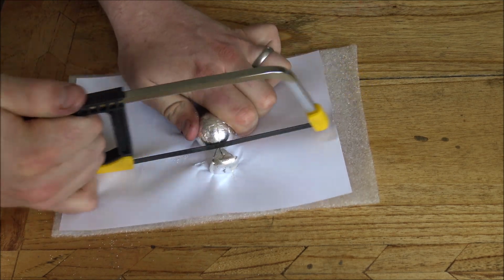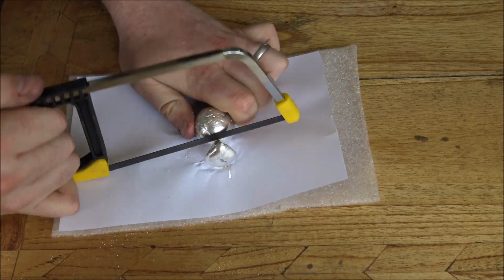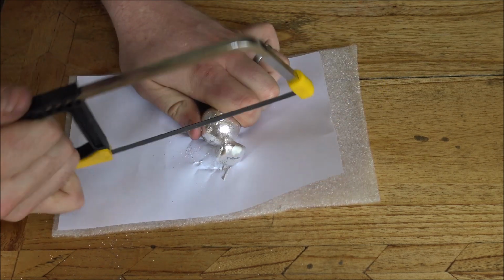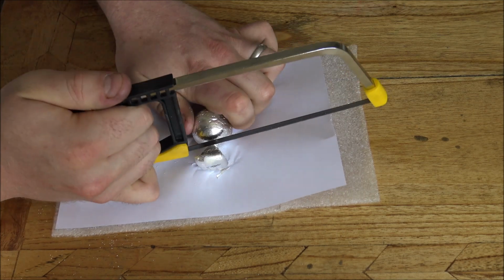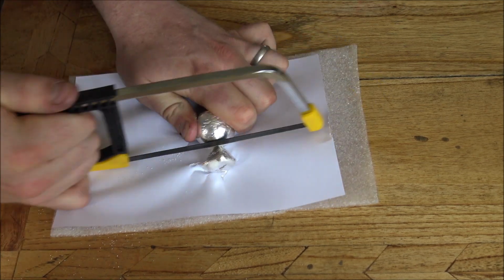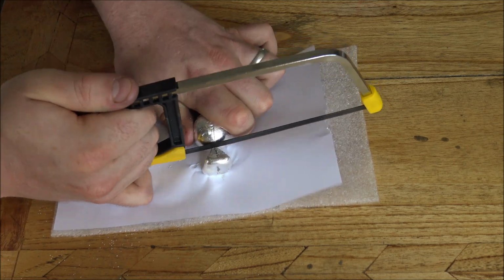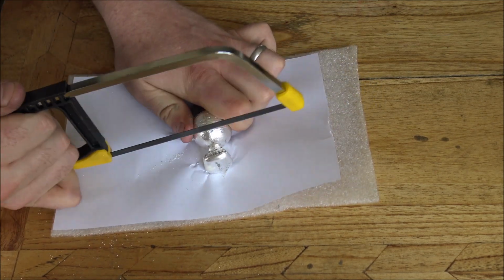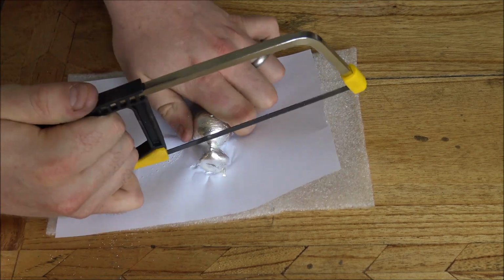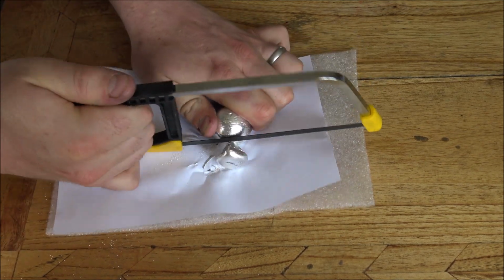I suppose one could have designed these with a little bit of a thinner spur, but when I was putting together the design with G&G Machine Works, I wasn't sure, because I've never done any kind of spur and 2-part mould pouring before. I really wasn't sure whether the silver would get through, so we made what I actually thought was maybe even a little bit too small a hole in the first instance. However, it did work really well.